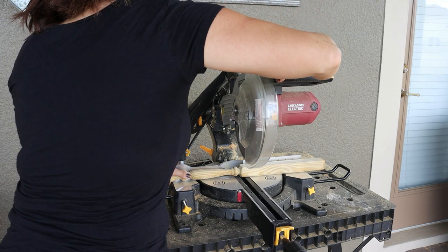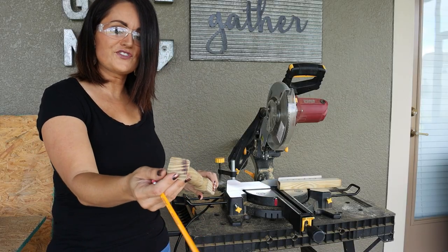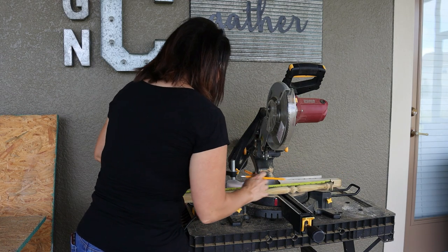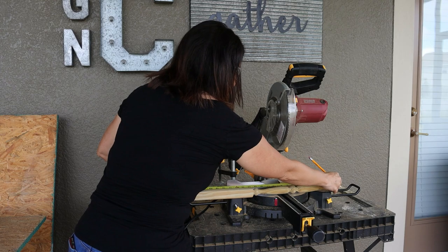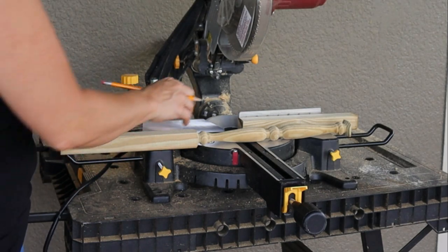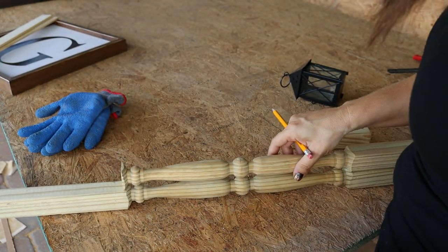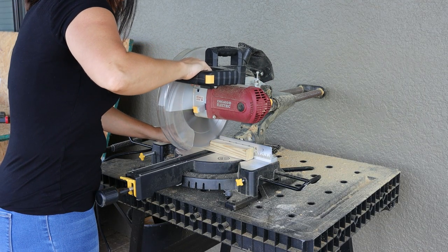You can see we've got a little ledge for the lantern to sit on. Mark to 16 inches down from the new cut — I initially marked 19 inches but it was too long, so adjust accordingly. Once you have your first piece cut, use it as a pattern for the second one. If you don't have a miter saw, a simple miter box works fine — they're only about $10 to $12 and you can cut these by hand.